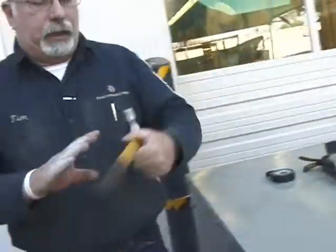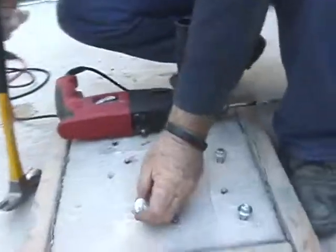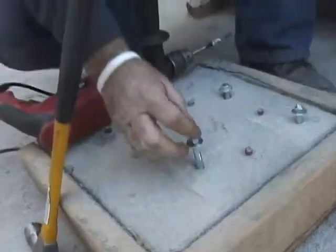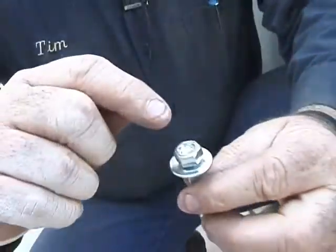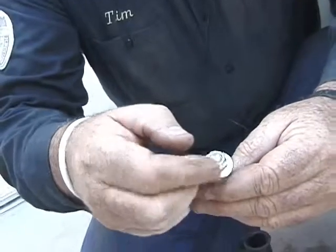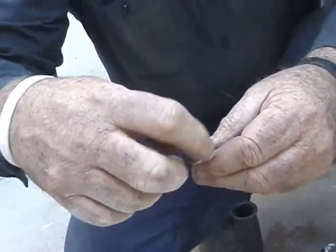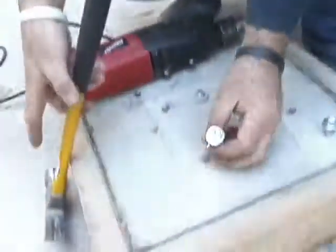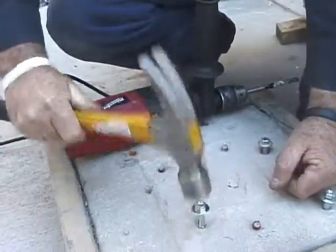All right, pick up your hammer and your wedge. Again, you're going to see all different versions of this. All right, so don't get locked in. And what you want to do is you're going to tap on this. So you want to bring the threads up. You don't want your thread to be showing because it's going to damage it. So you run the nut up a little bit above it. Because if you have to do a lot of work on this, you're not doing it right.